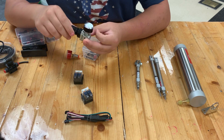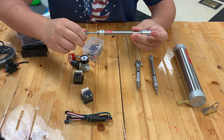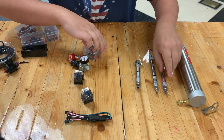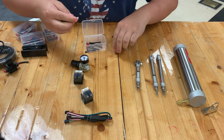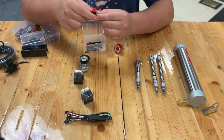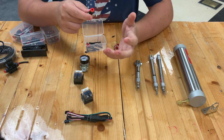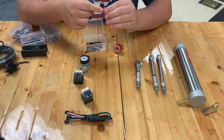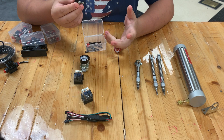The last components are the regulators. This is a flow regulator — it makes the piston extend a lot slower. And in here you have the pressure regulator, which is different: it adjusts how much pressure your pistons use, making them weaker or stronger. Generally you use it to make pistons weaker and use up less air for less forceful mechanisms.